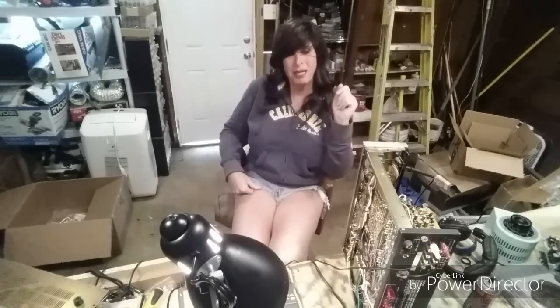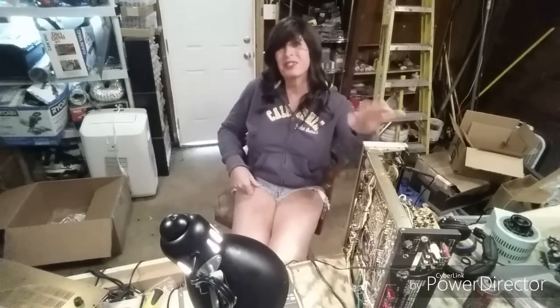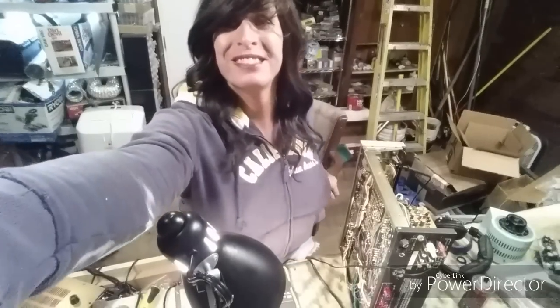I was a little fearful that maybe the transformer had gone bad. My good friend Drew suggested checking the power to the tuner board, and that checked out good. What had actually happened was one of the capacitors on the tuning board had gone bad. I went ahead and took the opportunity to change that out today. Come on down to board side - let's check it out. Time waster Friday? I don't think so. We've got a really nice unit coming to life.